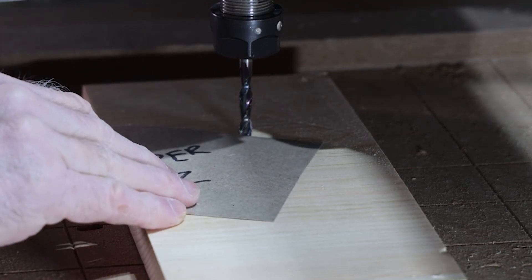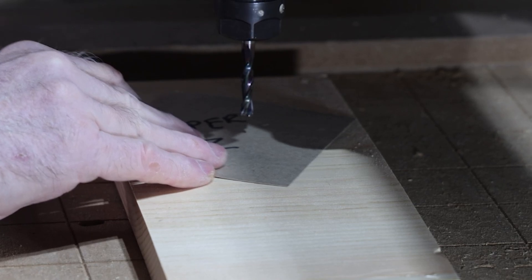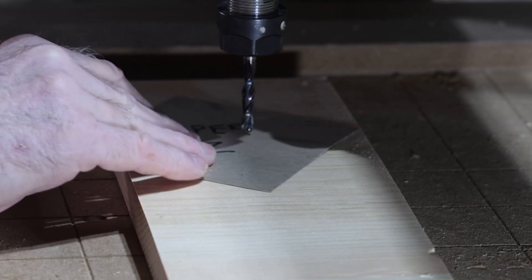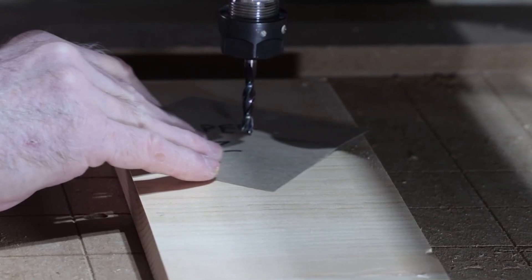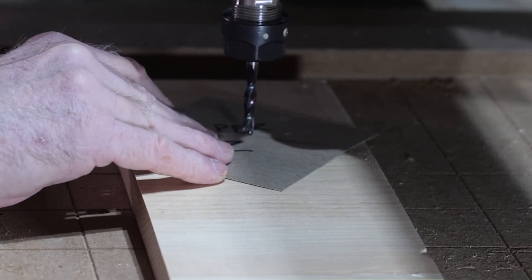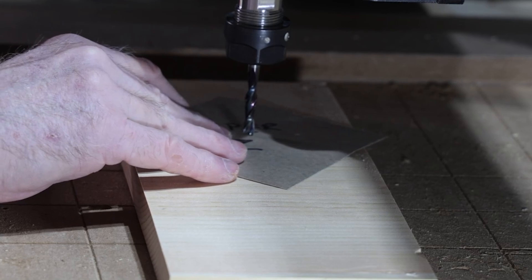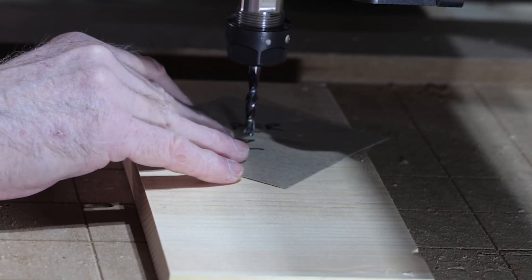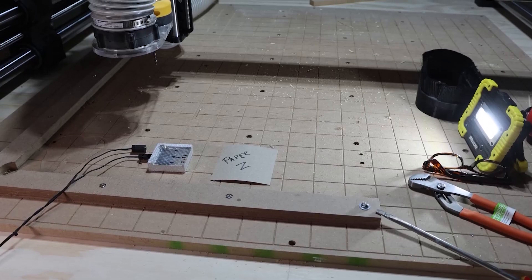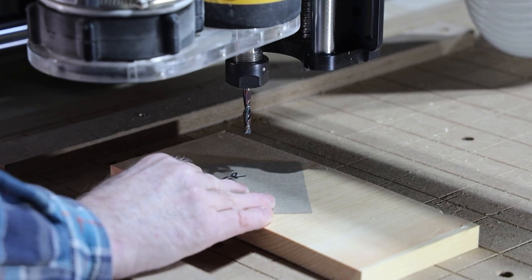Now for the classic paper method. This technique uses just a regular piece of paper and a bit of patience, which is sometimes in short demand in the shop. As you can see, I'm shuffling the paper while simultaneously tapping down the Z button on the Masso screen — quite the feat of coordination, kind of like tapping your head and rubbing your stomach at the same time. Once the bit is lowered manually, you'll want to move it down until the paper can't move freely but isn't tightly pinched. It's simple and effective, however it's not as precise as the touch block and it takes a little longer to get it right. The paper method is also more hands-on and leaves room for user error, but it's practically free and works universally on any CNC machine.